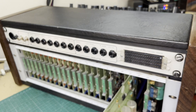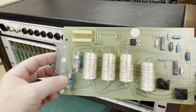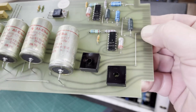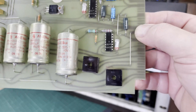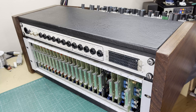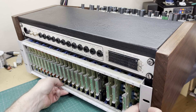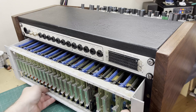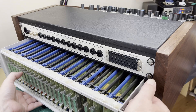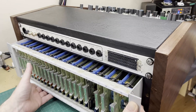Let's have a look at the second one. This is fairly similar. Oh dear - looks like this bridge rectifier is blowing. There's a crack right in the top of it. So I was going to see how far this casing comes out. Definitely not going to force anything because there's going to be loads of wires. I can feel it slightly tugging, so maybe if we take off this other panel at the top.